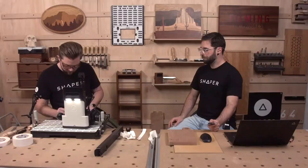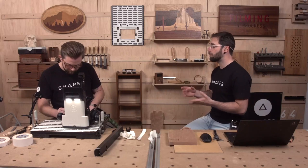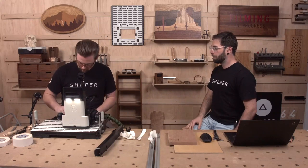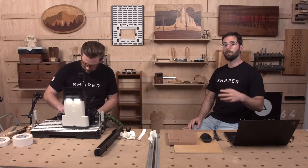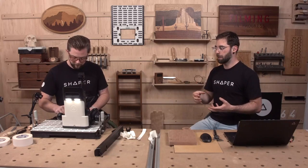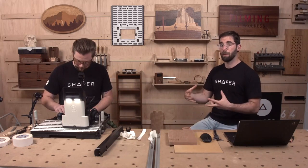Classic trade-offs. To go even further, you could use a down-cutting router bit — that would really prevent any fuzz from popping up on the edges. That's the difference between this style of inlay with thicker veneers and a thinner veneer like the 1/42nd-inch commercial veneer used for the Shiprock inlay. For the Shiprock inlay, we used a 1/16th-inch down-cutting helix bit, which shears the wood not only across but also down, preventing any fuzzies from attaching to the part.